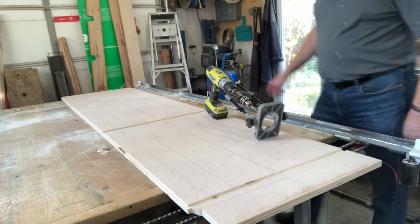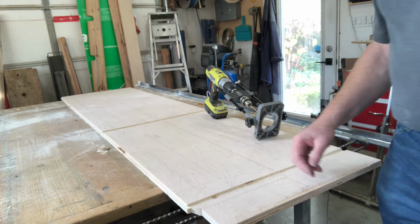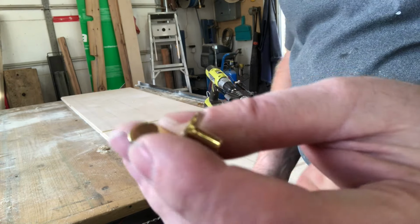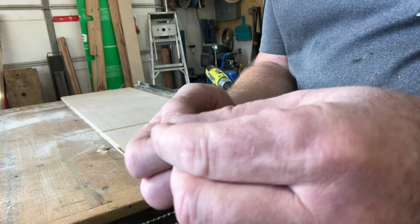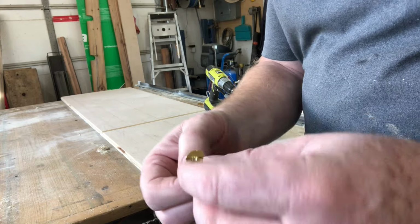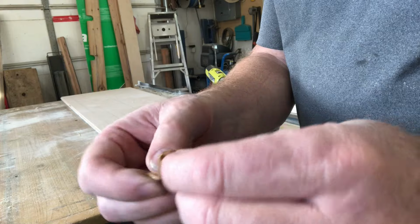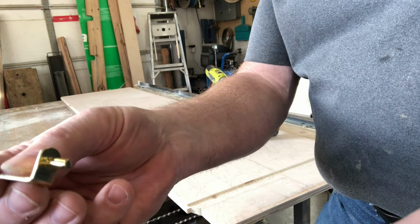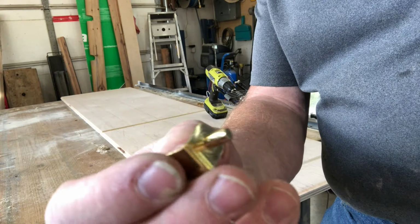Okay, we're set to drill a bunch of holes now in the cabinet sides to accommodate shelf brackets. And I've picked up just a sample. This is a 5mm shelf bracket. 5mm is common with European cabinetry, including that very famous Swedish cabinetry, whose name we understand to be the equivalent of common sense. So, yeah, but there are so many different varieties of these.